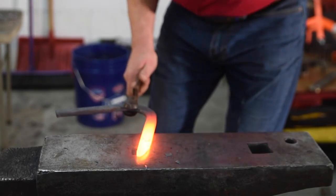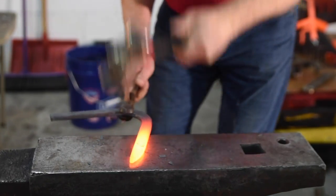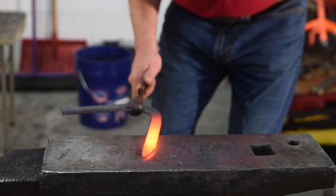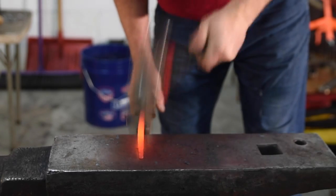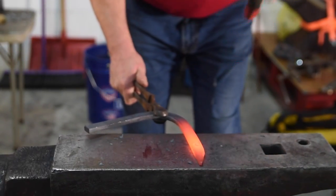So with the heart bar, quite a quick way of doing them, as I'm showing you here, is to do the heart bar so you can weld it from the inside of the shoe. So we're setting the bar up from the outside of the bar, mark usually around 2.5 inches, depending on the size of the foot. You're going to stretch it about 1/2 inch to 3/4, possibly.